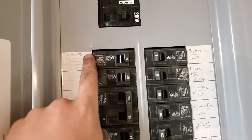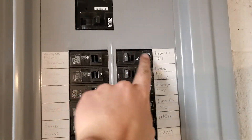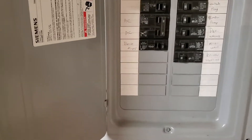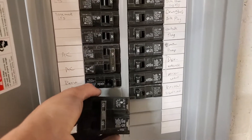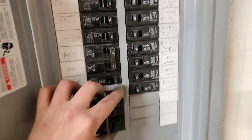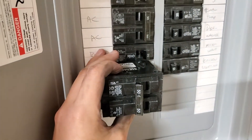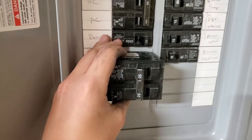These two hot wires don't go straight down — they go down and alternate, with each one sticking out on different sides, and they're on different phases. So when you get 240 volts, you put in a two-pole circuit breaker, and it's on both legs — each leg is 120 volts. Put them together: 240 volts. You can see the little knockouts show how the teeth work.